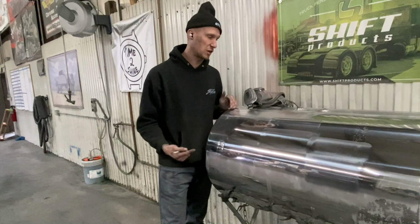The medium one is the quickest route for me. It uses the least amount of compound and gets me the finish I desire. As you start getting into higher end show quality stuff, lighter pressure is better: less hash marks, lighter pressure, simple science.